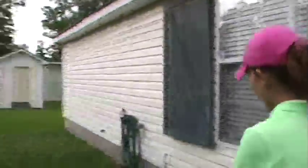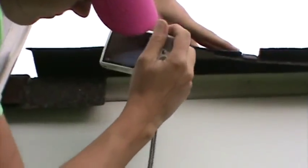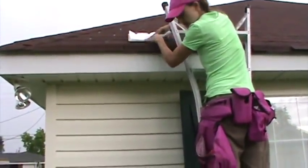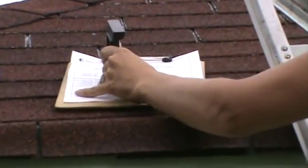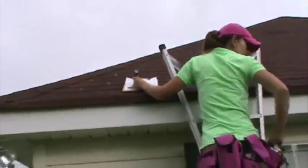We can hop on the roof. She's taking a picture to demonstrate how many layers of roofing there are, and here she's laying her clipboard down and using a pitch gauge to determine the pitch or slope of the roof — how steep it is. She's going to photograph that for the file. A steeper roof costs more to re-roof.